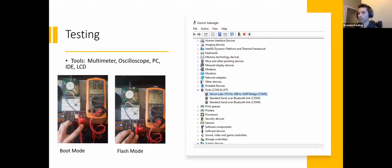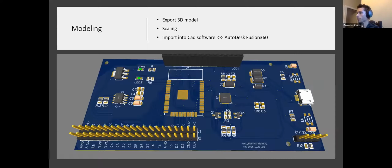But these are all things to think about when you're actually doing the layout and the routing and actual PCB design. But this worked out just fine. The buttons were fine. The flash mode should draw that pin high. We're getting a little bit more than 3.3, but again, that's all good because it's not actually going to the power supply of the PCB.